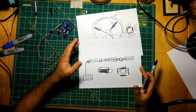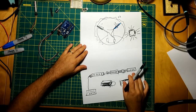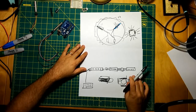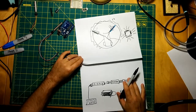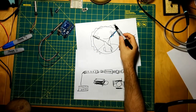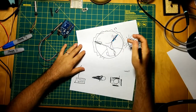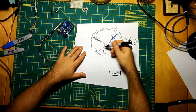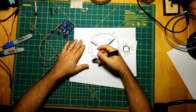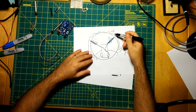Yeah, so that's sort of the system in a nutshell, a modular LED system which has some sort of visual display using those little OLED boards that you can then use to modify the pattern that's displayed on each output pin. Again, this being L1, or you could call it whatever, strip 1, and then change the pattern on each. So you could have standard strobes here on L1 and L2, and then L3 could be doing some kind of crazy rainbow effect, right? Or you could have L1 and L2 strobing and then have L3 completely turned off.